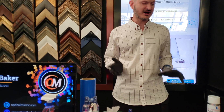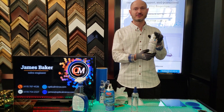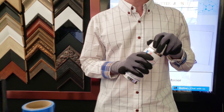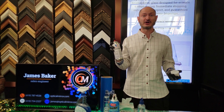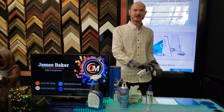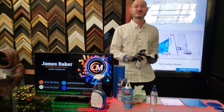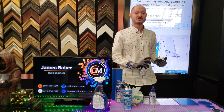The other product I highly recommend for smaller and more delicate optics is Pre-Coat 33, made by Universal Photonics. This is a specially formulated paint that creates a blue laminate on the surface. You want to hold it a fair distance away and use it in a well-ventilated area or even outside. Hold it roughly 12 inches away from your optics and spray evenly across. Make sure you have something behind it to prevent overspray onto your concrete or table surface. Apply at least three even coatings to generate a sufficient protective surface that can be easily removed.